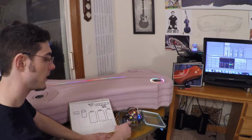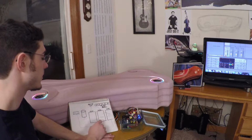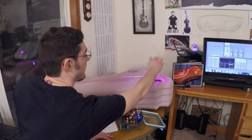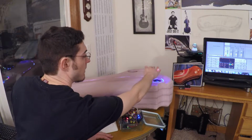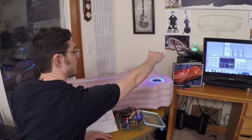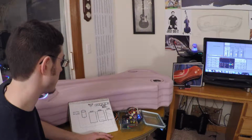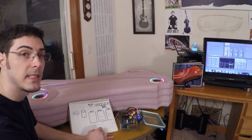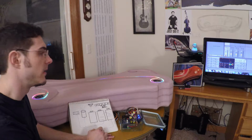It also sends it to the Arduino stack, which converts some of that incoming data to color wheels and different hue patterns that are used on the top of the model to create this effect of a decay of light of what you have already played, and it maps the color based on the distance to that spectrum. From there, the chip sends it out to those LED strips. We're using the FastLED library files that MIT has been gracious enough to share with the public, and in the spirit of that, we will be sharing everything that we create as well.